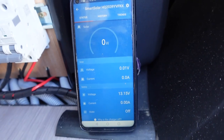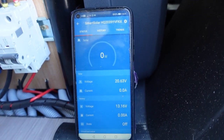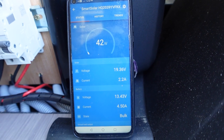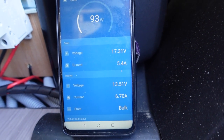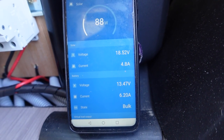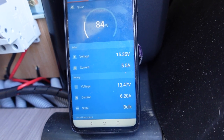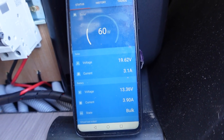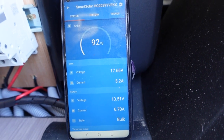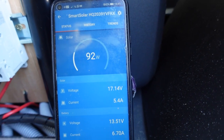Back downstairs logged into the Victron controller, switching it on. We're getting 20 volts coming in, as expected. Current wise, we're sitting at 6.6 to 6.3 amps - so even with parallel I'm getting about the same current as in series. The difference is the voltage - if you look at the voltage, it can actually drop down to nearly 15 volts at some point.